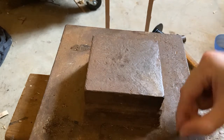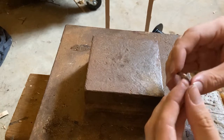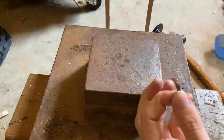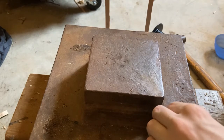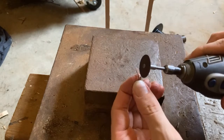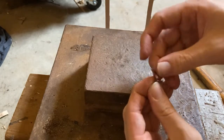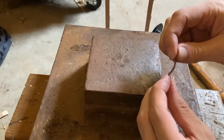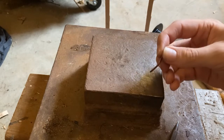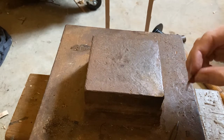Another thing is that instead of using the punch to begin making the opening, you can also just bend the piece a lot and then only use the cutting wheel. But the problem with that is that straightening it out after bending it weakens it a lot more, though that's less of a problem with this copper than with a flattened piece of nail.